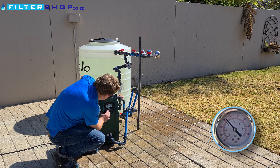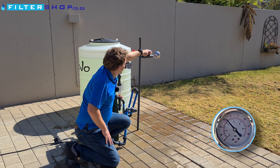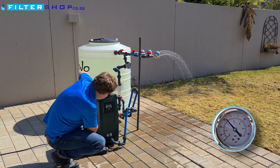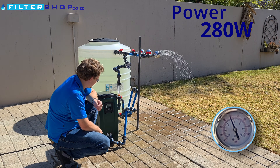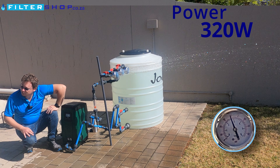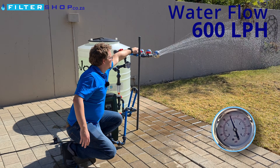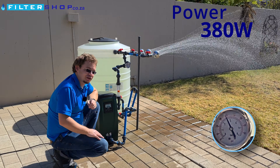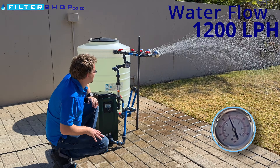Let's turn up the pressure a bit. At two and a half bar pressure now, with only a small amount of flow running, we're at 280 watts — very impressive. A single shower only climbs to 320 watts and we're sitting at about 600 liters per hour. Two showers at 380 watts and about 1200 liters per hour.